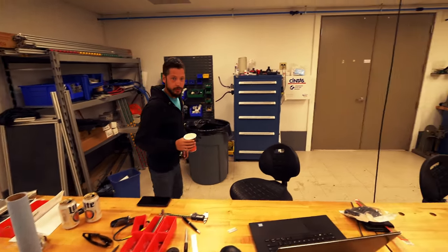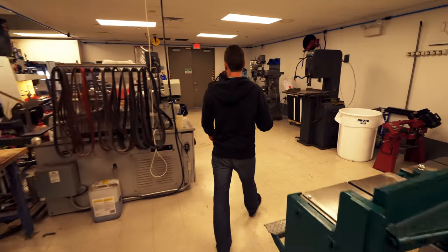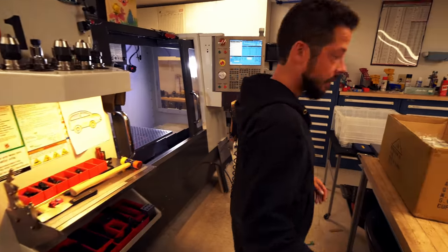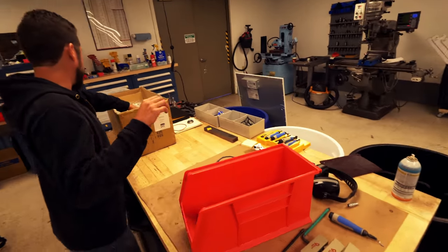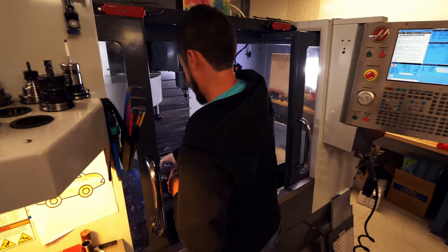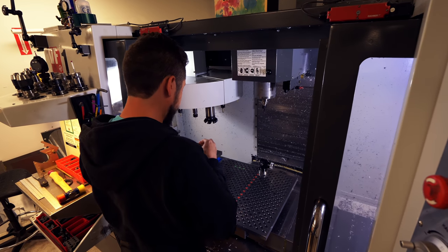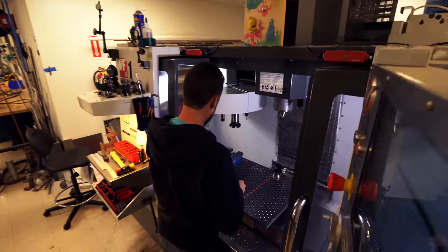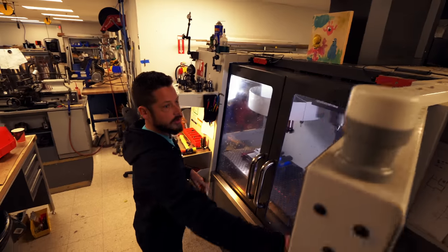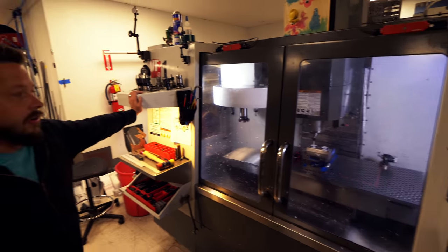Let's go to the mill and start with the rotor, which is the bread and butter of what makes a dosing pump work — this is the business end. Basically what we do is start with our rotor assembly. That's a CNC mill over there. We're still in the early stages of production so we haven't fully tooled up and we're only running two parts at a time right now, but we'll scale up. What we're doing now is putting a very precise bore down the center of the rotor.